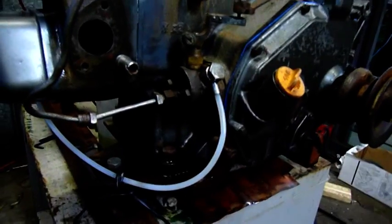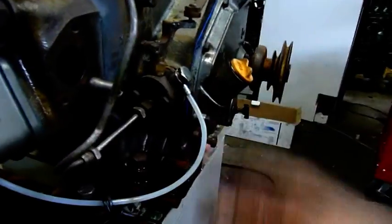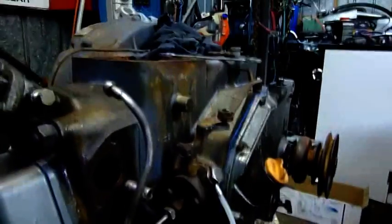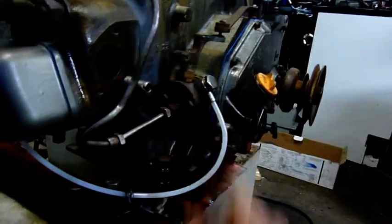It'll work. Definitely got to bleed these pumps very well — it took me a while to get prime. You know, loosen this banjo off and let any air and everything out of the system. I'm using a bottle of fuel to squeeze the bottle and force fuel out until it pissed out everywhere, then quickly tighten the banjo and it works. But if you get one little air bubble inside the banjo, it won't work.